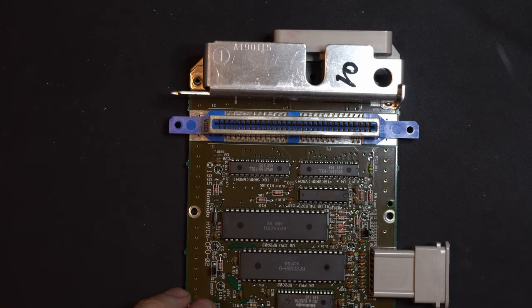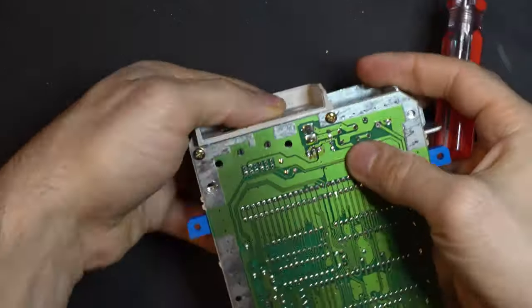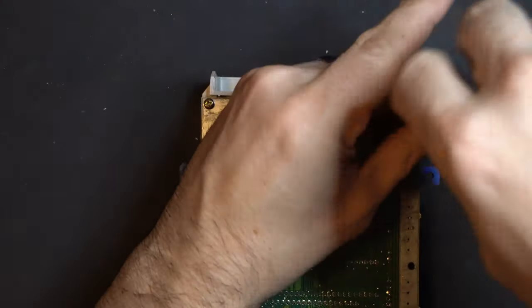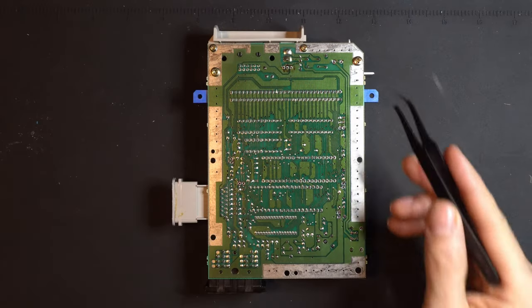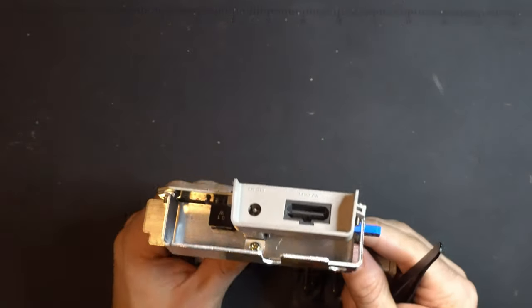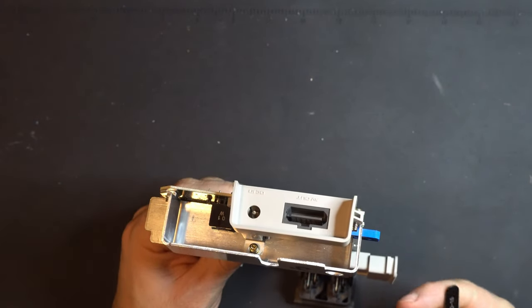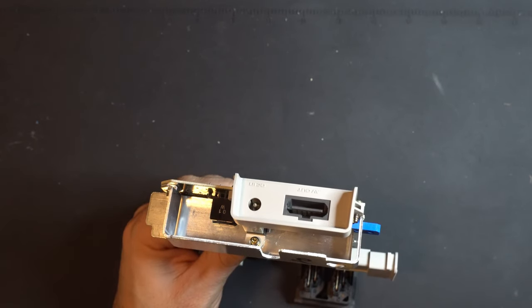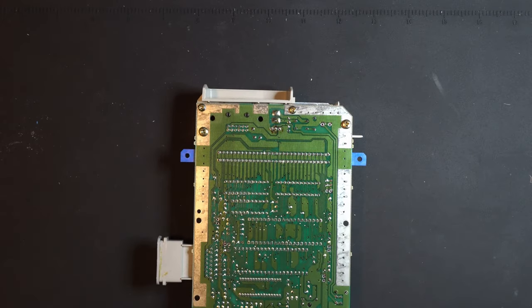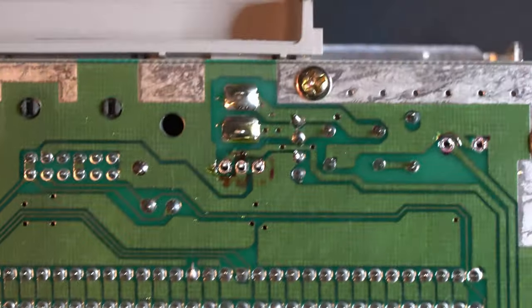So let's get those screws zipped in. Great, so now we have our three screws installed, the two screws here that hold down the heatsink, and there's also one more back in here that holds in the voltage regulator. Now you want to put all three in, and this is just a dry fit so that we can get the correct height set when we solder in those pins. So now you can see our voltage regulator poking through the bottom of this board right here.